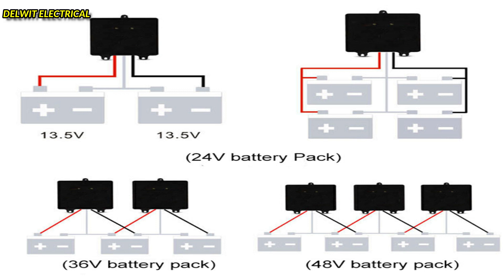For the 36-volt system, you connect a minimum of three batteries since one battery is 12 volts and three batteries give 36 volts. In this case you must use two battery management systems, giving you six output terminals. On the first BMS, the red connects to the positive of the first battery, the black to the negative of the second battery, and the white to the midpoint loop between them. The same applies to the second BMS: red to the positive of the second battery, black to the negative of the third battery, and white to the loop between the second and third battery. Together, the two BMS units continuously monitor all three batteries.